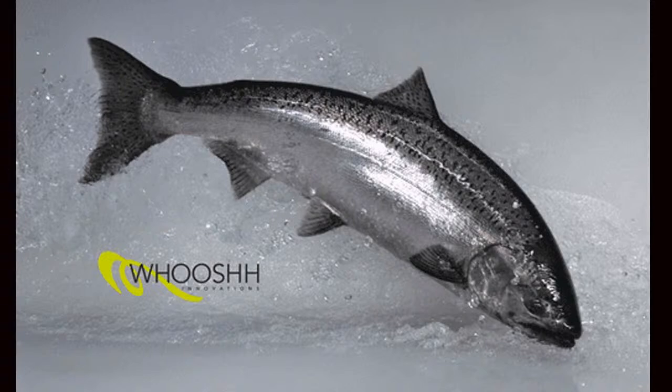We also developed what we call our fish recognition system. One of the challenges early on was, if you have a wide range of fish in a river, one tube can't transport every size fish. So we had to get the fish into the right size tube. Oh, of course. And so this is a scanner in the automated system, which we now call our Whoosh Passage Portal. It would take a picture of the fish, actually 18 pictures of the fish, before they reached the tube, and we would direct the fish into the appropriate tube. So this is what the fish look like coming. They've just come over a false weir, and now they're sliding for about half a second on this white background that you see.